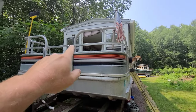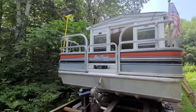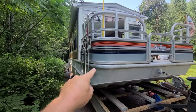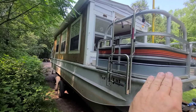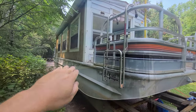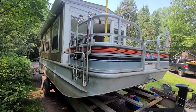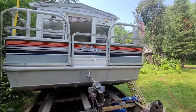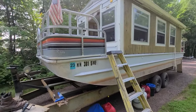So what I did, if you guys remember, I just had the piping, which was open. And I put this on there to give it a little more freeboard, you know, catching some waves, repelling some waves. But I kept a little bit of a gap there so it can drain. I'm not going to put doors on the side, not solid doors. So water that does get up on the deck can find its way off, because I'm always going back to Mobile Bay and the Shanty Boat Beagle Adventure and how that boat was handling it and needed to shed the water off the front. You can never really fully encapsulate the decks on a boat like this, because the water won't be able to get off. If it gets on, you want it to get off as quick as possible. Some of that is driving, but we'll get back to that.